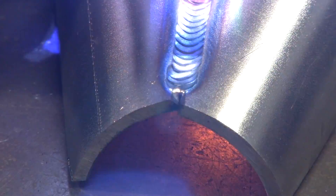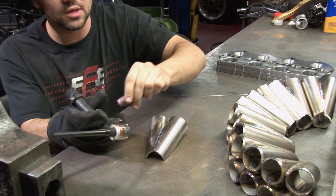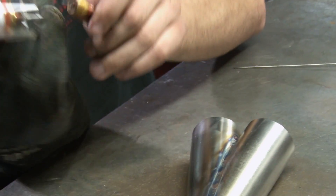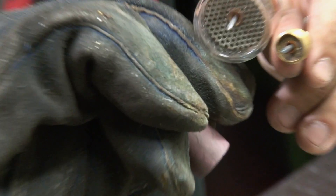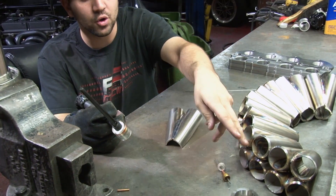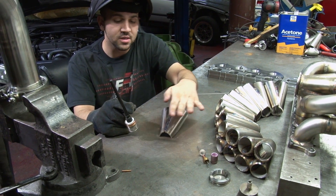If I had a traditional lens — a regular gas lens like a Weldcraft, or CK also makes them — these are the regular sized traditional gas lenses, and they're much, much smaller. You can see the comparison right here; it's maybe a third of the size. You have a much smaller path before your gas coverage is no longer covering, so I move about an inch and stop.